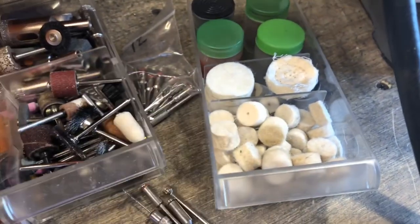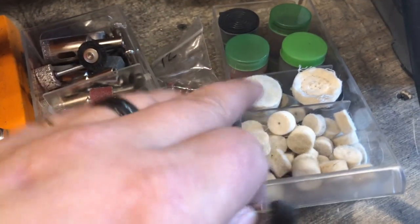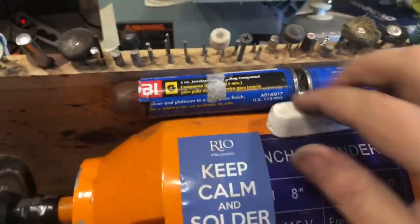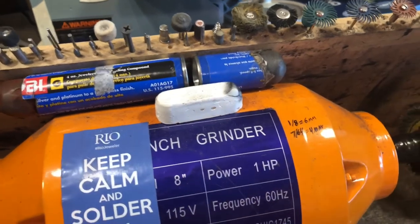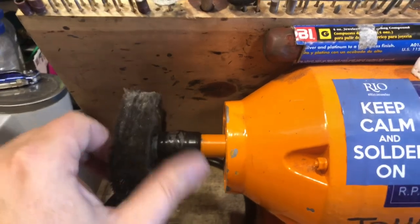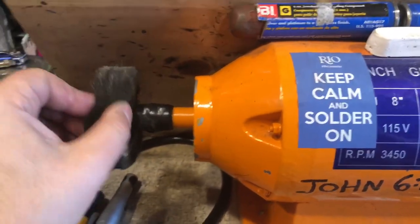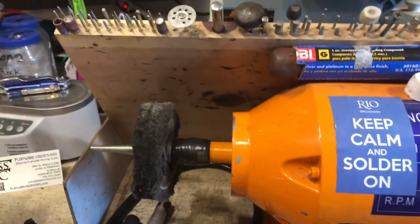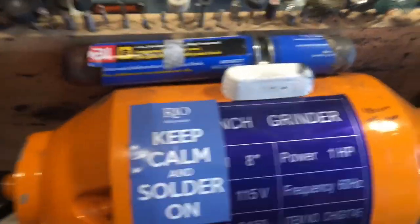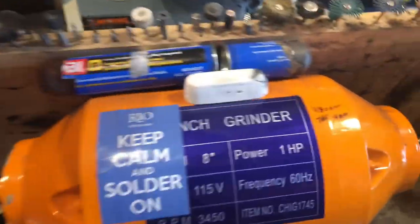I have my little buffing pads here. These come in different sizes and different softnesses. Most of these are felt. I do have a couple of buffing pads I'll use with the polishing compound. Mostly what I use is the red and the black — that's all I had to start with. I use my black on a stiffer polishing wheel and then my red on this softer buffing wheel. Now I have the white, and I'll use that on some of my new buffing pads — this one really puts a real high shine on them.